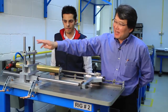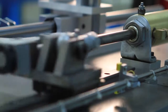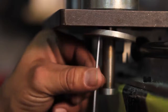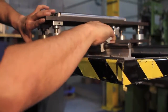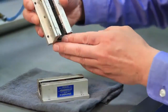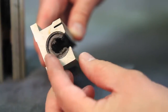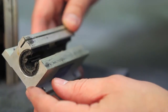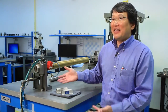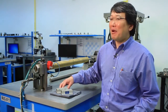We've gone ahead and applied the same load that was on the prior bearing. These bearings clearly have seen better days — we replaced them during part of our standard maintenance cycle. You can see the whole bearing is actually fairly dry, and the lubrication that is there is caked on and discolored. Rather than waiting for a failure, you want to maintain bearings on a regular cycle. In this case, there was no clear manifestation, and it's those hidden failures that are probably going to be worse.